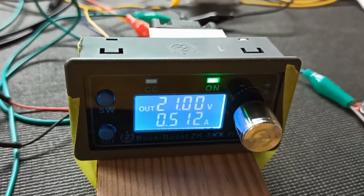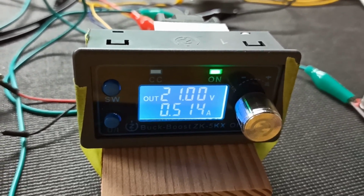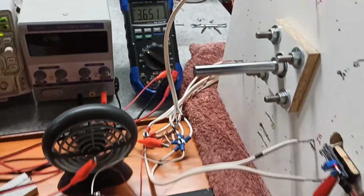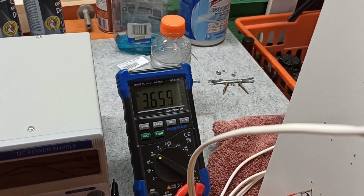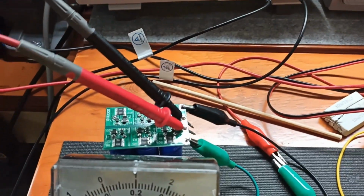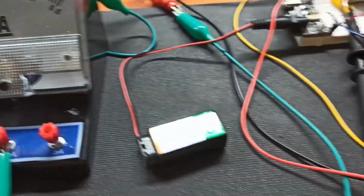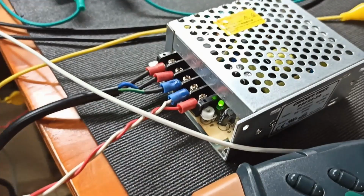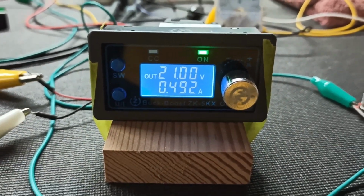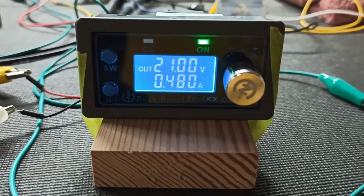Same amperage, but it's gone up. So more is being allowed to flow. All that's good. Voltage is going up. So that's back EMF collected into the capacitor bank. It's going into there. Our amperage has also gone up. Power still coming from here. Nothing's adjusted. Just this is at 21 volts now. So we're at half an amp basically, floating below half an amp.